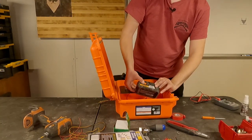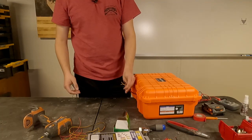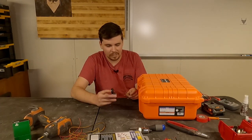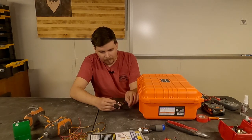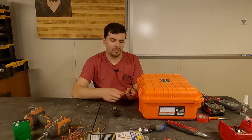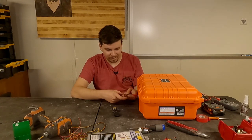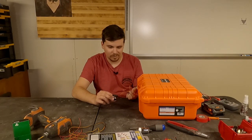Let's go ahead and disconnect power in case something goes wrong, even though I know the master's off. On the outside of the case, I have got my pigtail of wires. This pigtail of wires is what I will be wiring into this socket — I will solder each one of these in line as to what they are. One of them will be my ground and the rest will be my pad select as to which pad's which. I will go through and label what each one of these wires is because I have no clue, aside from the fact that I started on a yellow — so one of these yellows is one and the other one is four and the other one is eight.